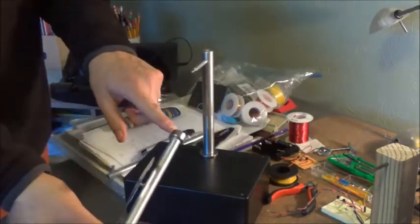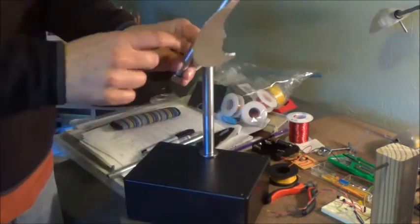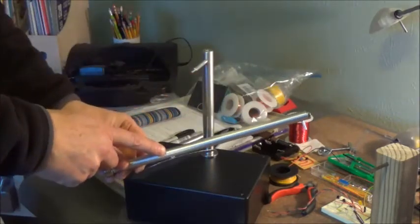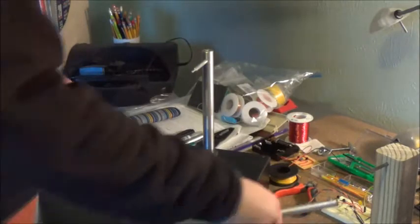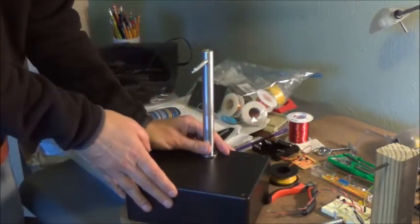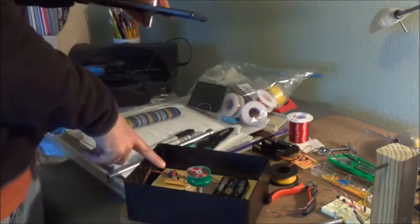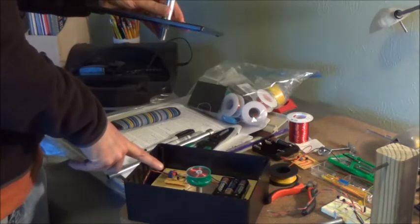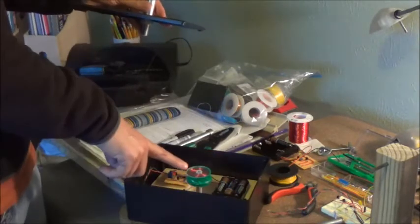This big magnet down here is the main driving magnet, and this object is also connected up through bearings onto the main rod. The box contains the mechanism that runs it — a circuit board with transistors, resistors, diodes, battery-powered.